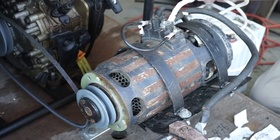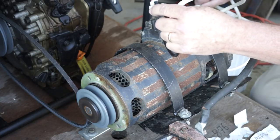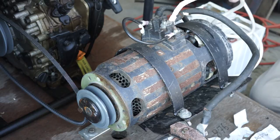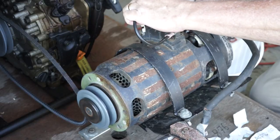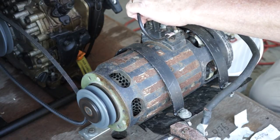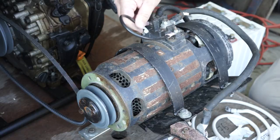If I put the field back on while it's running, it's going to drag it back down like regenerative braking, and there's almost no torque when I speed it up like that. It runs fast without the field. You can see that kick — that's because I still had power to it when I put the field back on and it came down fast. That's what these things can do, so you might want to play with that.